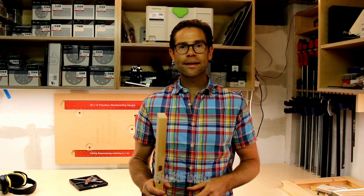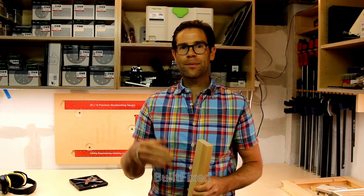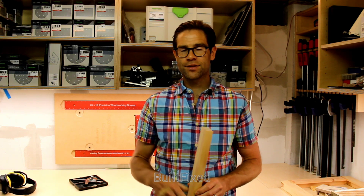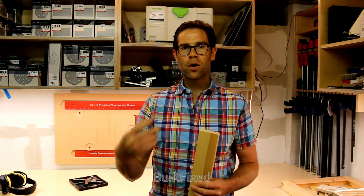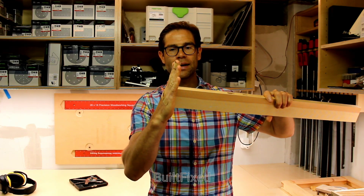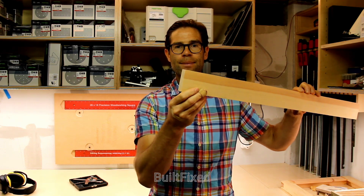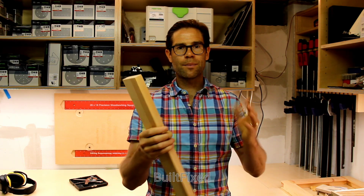All right, let's wrap up. Here's my opinion: I like it, I think it's pretty good. It's going to be a huge help for me to see what I'm cutting from the wheel point of view rather than looking at a sticker on the front of the saw. Now if you're the type of person that comes to your workshop and does woodworking with a machinist's tool, you'll probably be very disappointed — it is not that accurate nor precise. But probably for most woodworking applications this gauge will get you most of the way there. I say most because as a cut gets higher and higher, any little bit of inaccuracy becomes more obvious out at the end of the cut. This piece I cut here for the sample is 65 millimeters high, which is about 2.5 inches, so keep that in mind.